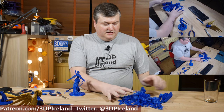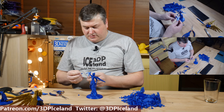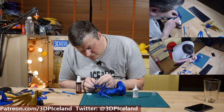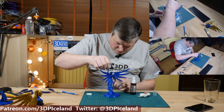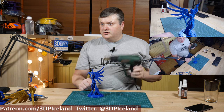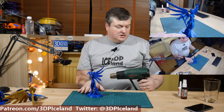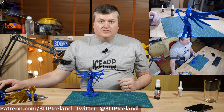That was quite a task. There were a lot of supports and the model broke in several places. I have all the pieces, so I have to just glue them back on. There is a little bit of damage on the base from the supports, and I'm going to try to use a heat gun to even out the surface at the base. The model is looking very good, and it was no problem using CA glue and the accelerator to glue everything in place. The heat gun worked quite well and I'm going to show you close-ups of the model.